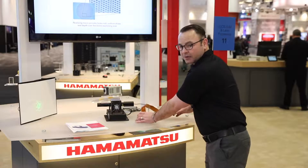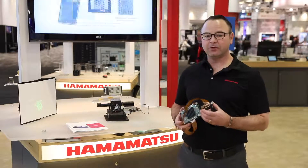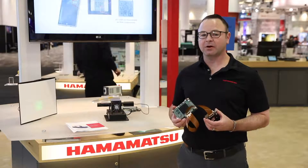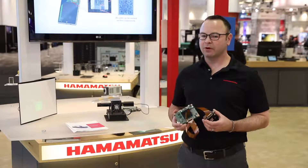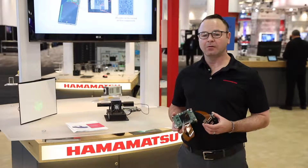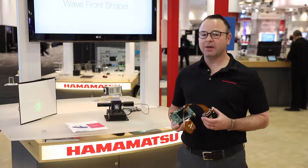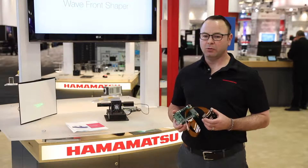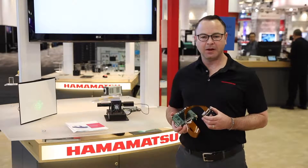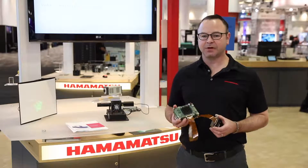The new X15223 model has a large pixel array of 1024 x 1280 pixels and small 12.5 micron pixels. Our SLMs operate over a specific range of wavelengths. We offer SLMs that work from 400 nanometers out to 1550 nanometers, including some broadband visible spectrum models. We utilize dielectric mirrors for maximum reflectance up to 98%. The new X15223 has a smaller package than its predecessors.